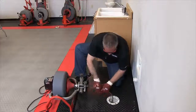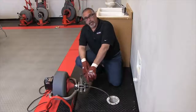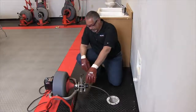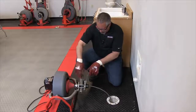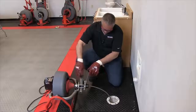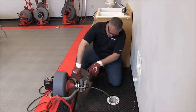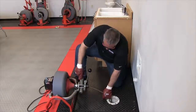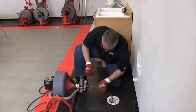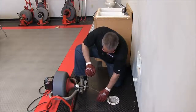That's the noise that the machine will make when it's under stress. Now that we've pushed past the T that's there, I'm gonna go ahead and put this in advance and bring it down till I feel some tension. I'm starting to feel some tension, so I'll give it about a half a turn. There we go — give it enough so that the machine can push the cable out.